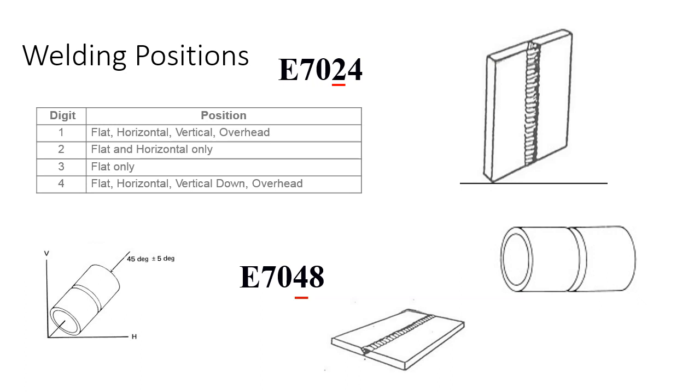When we're talking about welding positions in that third digit, this is what we're talking about: the position in which you're going to make the weld. In our upper right-hand corner, that would be a 3G weld. We would be welding uphill, going in the vertical direction. It would be like walking up to a wall and welding up the wall. That would be vertical. Horizontal is if we went to the wall and went crossways on the wall. I don't have that picture shown. In the bottom left-hand corner, there's a flat piece of plate. That's 1G, the flat position. Welding in the flat position would be like pouring water on the floor. We just put it on the floor, and we're going to weld in that position.